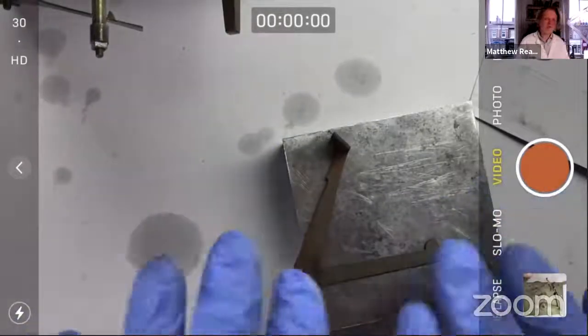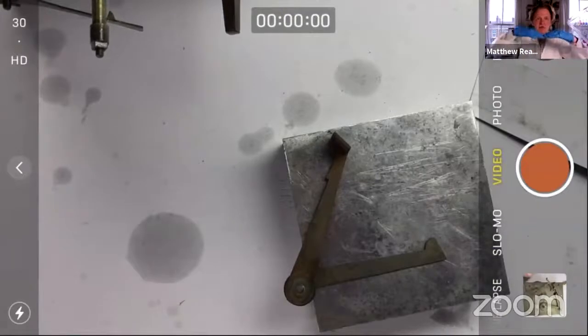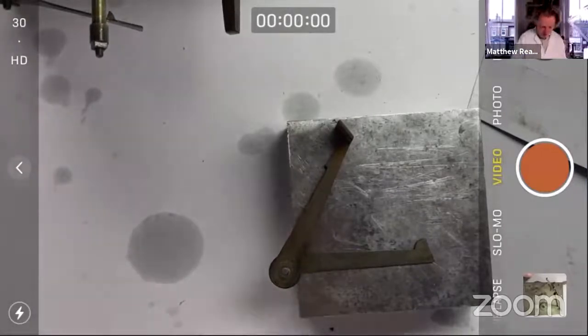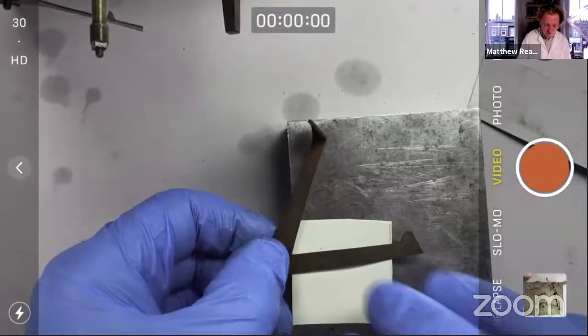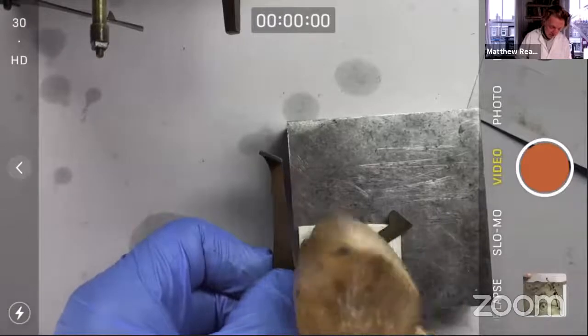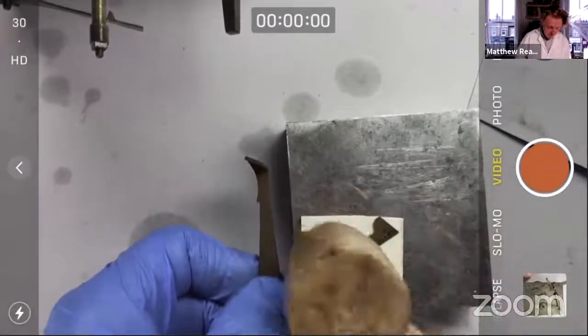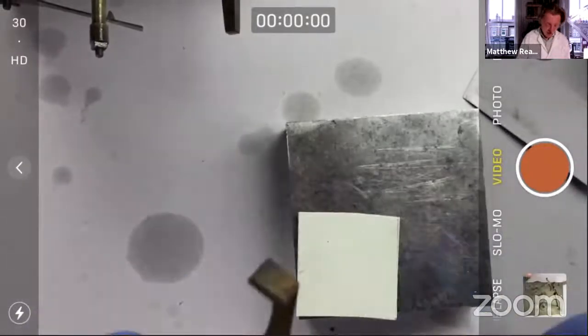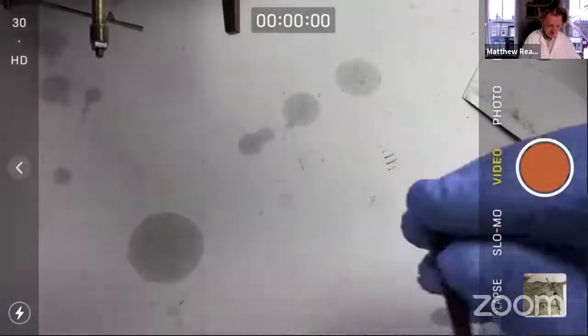Now, what we want to do now is we want to make the brass just curl up ever so slightly, because now we've straightened it, it's no longer being lifted by the pin. So if you hammer it on a slightly compliant surface, it'll just begin to curve a bit. So for that very purpose, we've got little bits of lino, which were left over from the bench top. You can see there, just curved it around. The metal is actually surprisingly malleable.